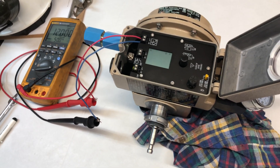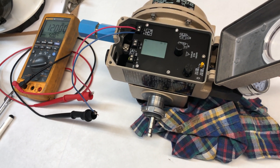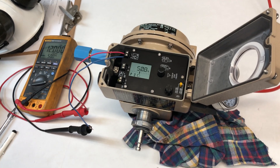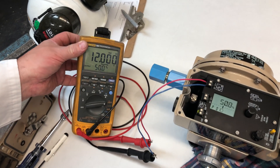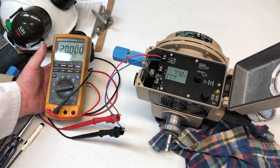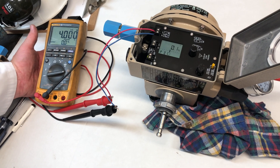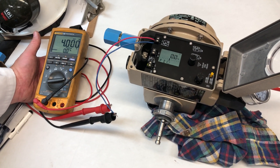We assume that it travels all the way up and down. It stopped at 50% only because I left the milliamp at 12 milliamps. You can check it by going to 20 milliamps — here it's at 100. Then at 4 milliamps, it's closed — zero, because it's fully closed. That's it.